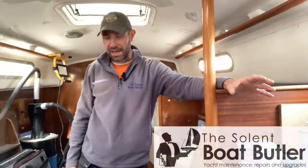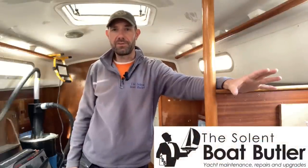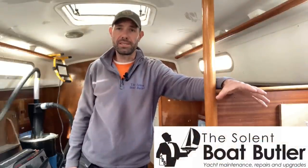She's actually called Countess Charlotte and she is a 32 that is with me for quite an extensive refit. In this episode you're going to see me continuing with the inside works here. I've got the water tank in now at the end of the last episode and I've got my GRP, my glass fibre sheet, bonded in over the top of the water tank and next I'm going to be making up some floor bearers to go in the floor and glassing those in.